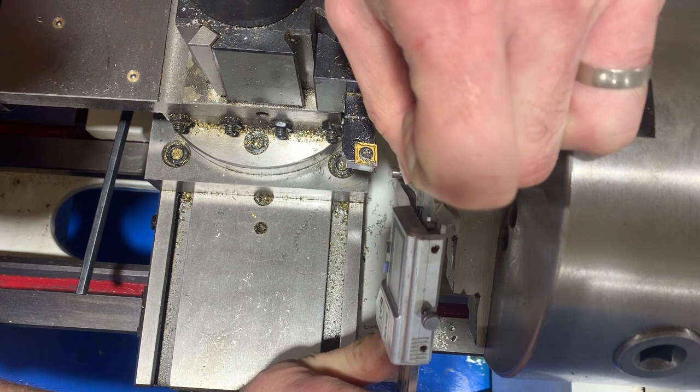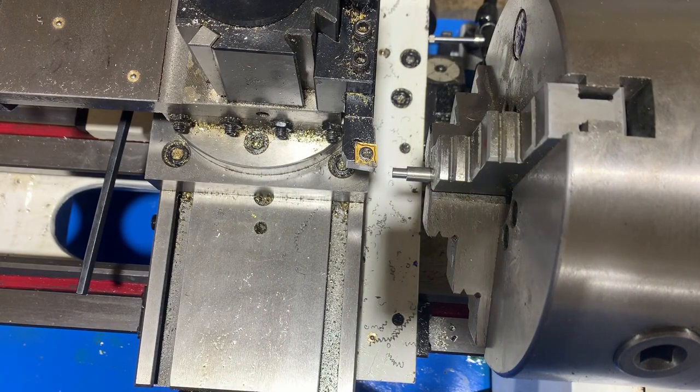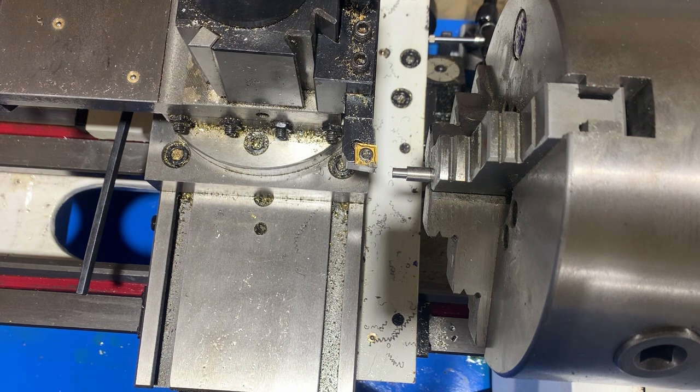So we're at 170 thou. So I'm going to take off a fraction over 100 thou, or 100 thou and 102 thou, sorry. So I'll do, I had some backlash. Heat that up, all right. I'll do a 20 thou pass, should take 40 off the diameter.